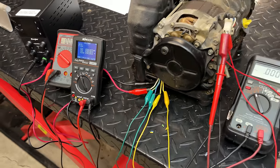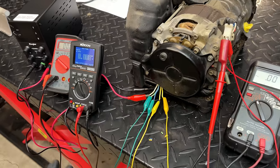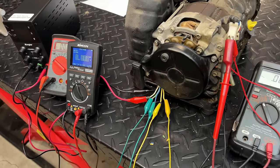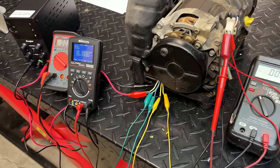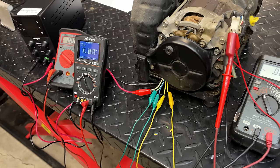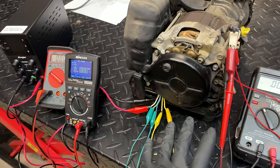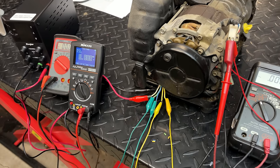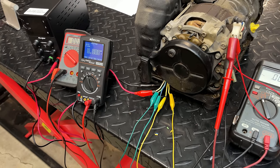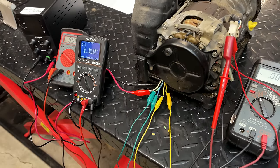And as luck would have it, I was speaking to a friend across town, Dave, who owns an EM500. He had the same issue with his a couple years ago with the AVR, high voltage. He ended up paying the 170 euro to fix his generator. And that's what I'm most likely going to do. But he also bought the service manual. So I'm going to get my hands on that. I just want to double check what that manual says as far as the resistance values and any other tests I can do, because before spending that much money on a part, I want to make sure it's the right part. So let me get that manual. I'm going to read through it and share with you anything of interest.